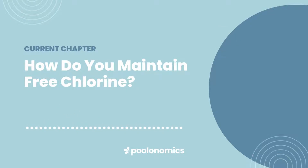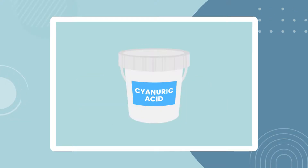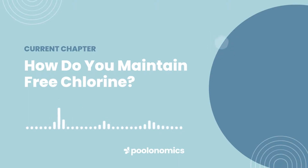How do you maintain free chlorine? All pools lose free chlorine over time — that just means the chlorine is doing its job. As long as you continue to add more, you'll always be able to replenish what you lose and maintain a relatively stable free chlorine level. As mentioned earlier, tablets are ideal for this because they slowly release chlorine as they dissolve. You also have some control over how much chlorine is released over time by adjusting the number of tablets you use. An alternative approach is to add granular or liquid chlorine on a daily basis, adding a day's worth of chlorine loss with each top-up. If you have an outdoor pool, cyanuric acid or chlorine stabiliser is pretty much non-negotiable for maintaining your free chlorine level. Most tablet and granular forms of chlorine contain cyanuric acid. You can also add it separately if you're using unstabilised chlorine, such as liquid chlorine, which is beneficial seeing as too much cyanuric acid will lock up your free chlorine and prevent it from working effectively. This is known as chlorine lock.